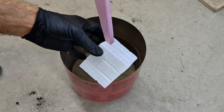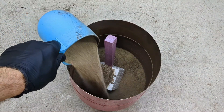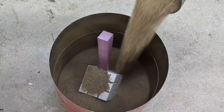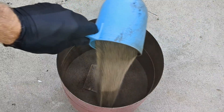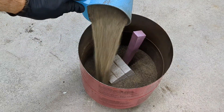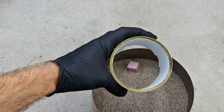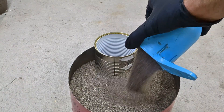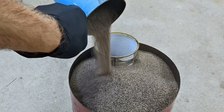Now it's time to bury it in dry sand for the lost foam casting process. Normally I coat it with a thin layer of drywall mud, which really helps with the surface finish — I really wish I did it in this case. Lost foam casting is super simple: all you have to do is take a piece of foam, bury it in a container with dry sand filling the container all the way to the top, and vibrate it so you get good compaction of the sand surrounding the foam pattern. Fill it all the way to the top, then take a can with a hole cut out of the bottom and put it right over the top of the foam — this is where the molten metal is going to be poured in. Make sure to surround the container with more sand to lock it into place, because you really don't want the can to fall over while pouring molten metal.